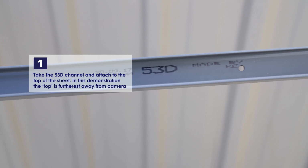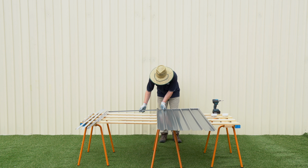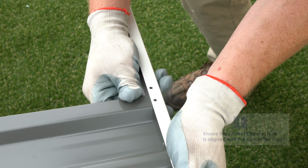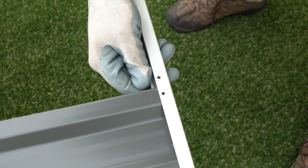Take the 53D channel and attach it to the top of the sheets using the Snaptite method. The short side of the channel will need to go to the outside of the panel. There are 2 holes in the center of our channel. Make sure the hole furthest away from the door space is aligned to the 34A sheet. We'll need the other one later on.